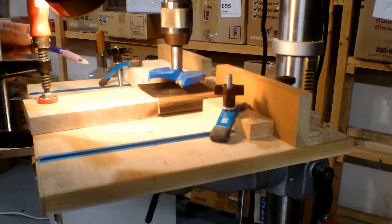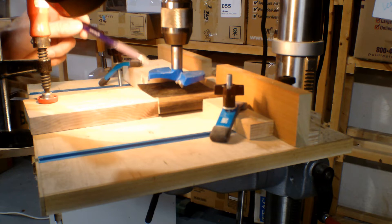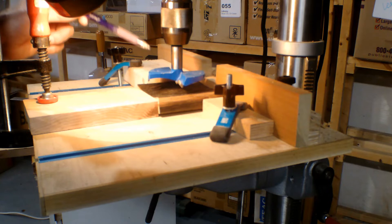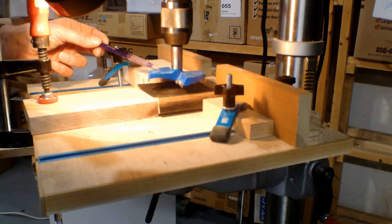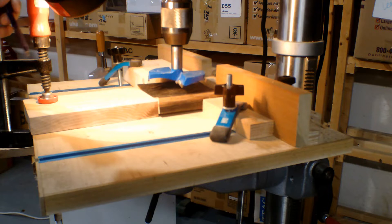I'm making this whiskey smoker. First thing I'm going to do is work on the bottom — what I'm calling the bottom right now is the charred side. That's going down and on top of the glass. I'm putting a 90-millimeter depression, about 1/8-inch deep — not much, just enough to keep it centered on the glass so it doesn't slide off. I'm doing that with a 90-millimeter Forstner bit chucked in my drill press. If you don't have a drill press, you really need to get one — even a small 9- or 10-inch press works great. You can't use a 90-millimeter bit by hand. It's easy for it to get away, so this is much safer and more stable.